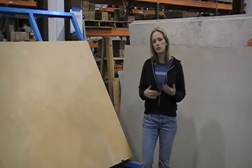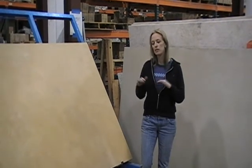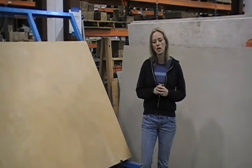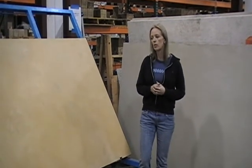And while that character and variability was really desired by a lot of the people that ended up buying Squak Mountain Stone, we recognize that over the years there are a lot of people that chose not to use Squak because they didn't like the number of seams that came from the smaller slabs, they didn't like the variability between the slabs, and they were concerned about the installation cost from the fabricator because of the thickness variation. And so we decided that in order to address all of those problems, we needed to grow the size of our slab.